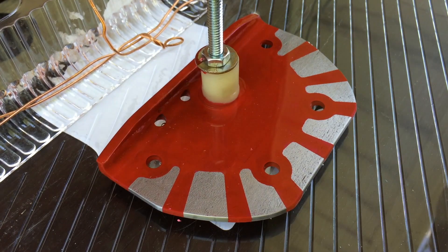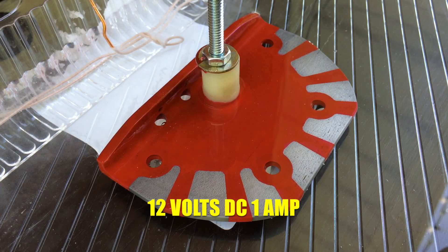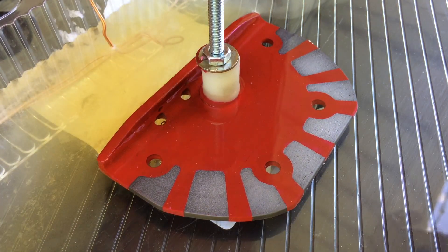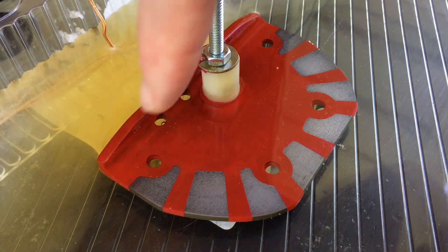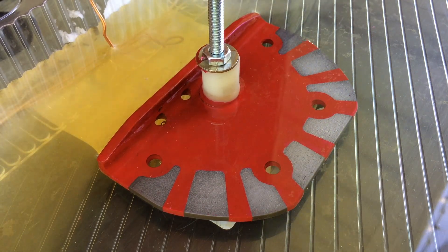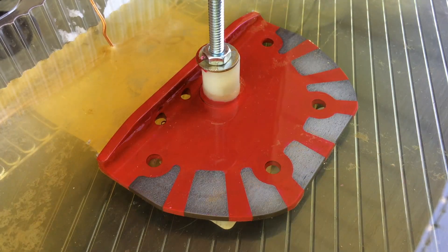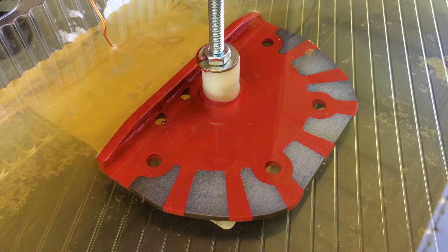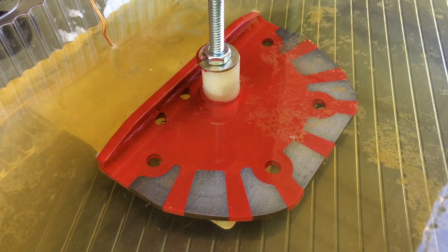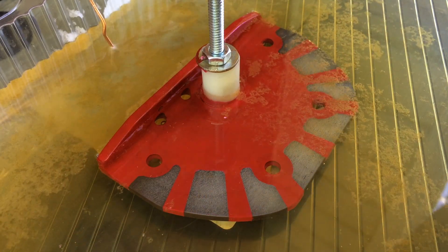The power supply is ready to go and it should start bubbling right away. I can see a little bit of action going on around the outside of the bridge — a cloudy ring forming. The yellow back here is from the copper wire. One thing I noticed last time was the further away from the copper wire, the less etching happened, so this time I tried to make everything very symmetrical. I can also turn this around halfway too.